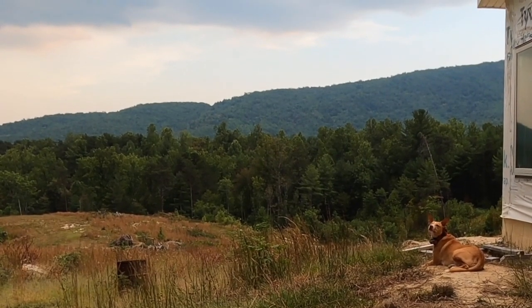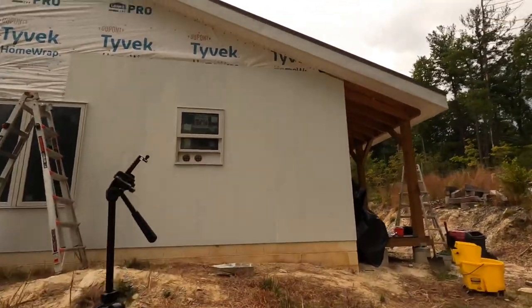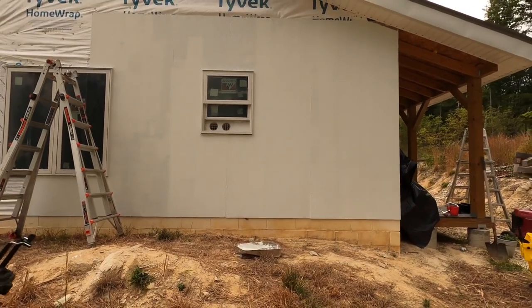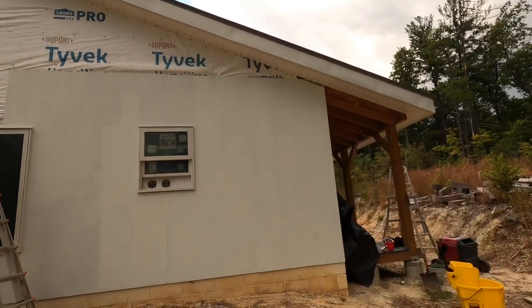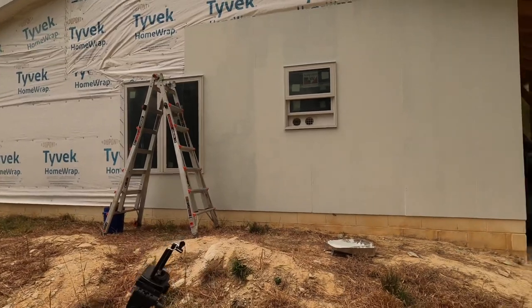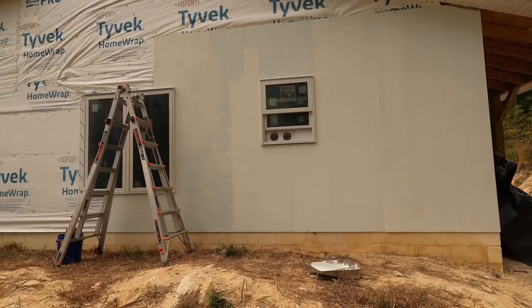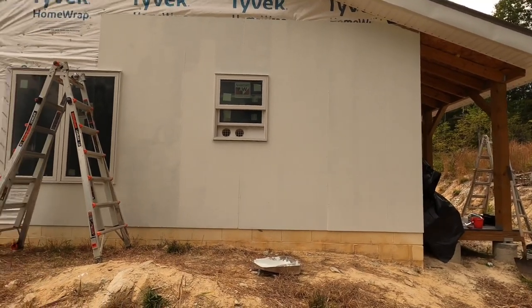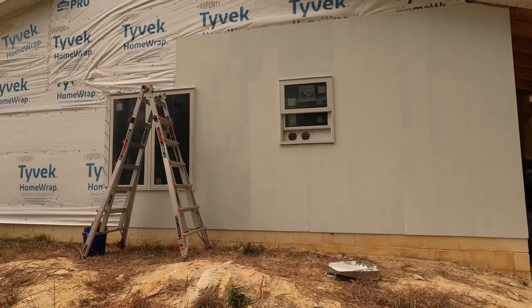That dog leads a pretty good life — not bad for a little rescue dog from the streets of Cadiz, Spain. I'm pleased with it so far. When we painted before, everything took at least three coats. I haven't cut anything in up there yet; I'll take care of that, put a couple of coats, and then do the last coat to bring everything together. One of the cool things about paint is it hides flaws — but it also shows you some flaws. I found a few things on this wall I don't like. Some of my nails are sitting a little proud, so I'll have to go around and seat them and make an adjustment to my nailer so that doesn't happen next time.